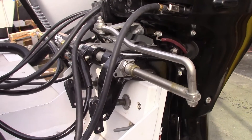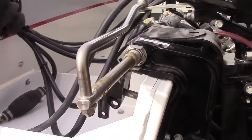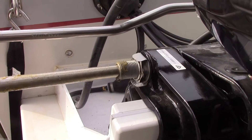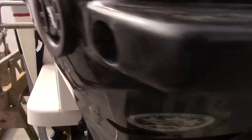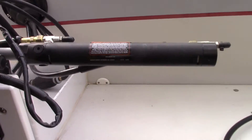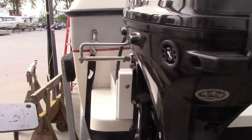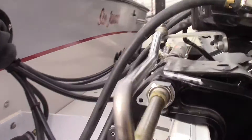The cylinder I used is the HC537E-3. One thing you do have to watch out for is that this doesn't go out beyond the side of the boat, especially when you're docking. You need clearance on this side as well. This side is fixed — it doesn't move, it's just this side that comes in and out. The motor is centered right now, so it will come out more, but you just have to watch for that.